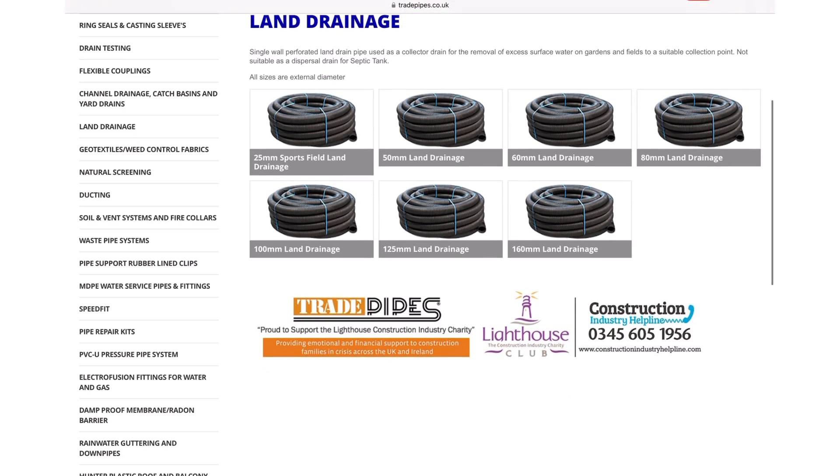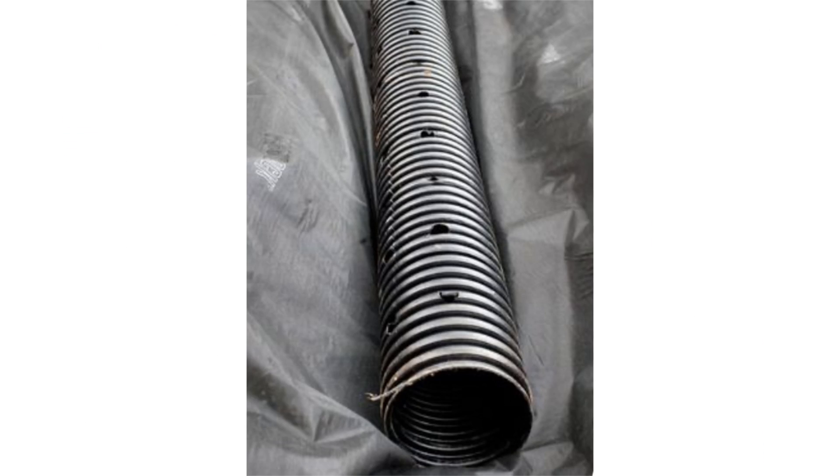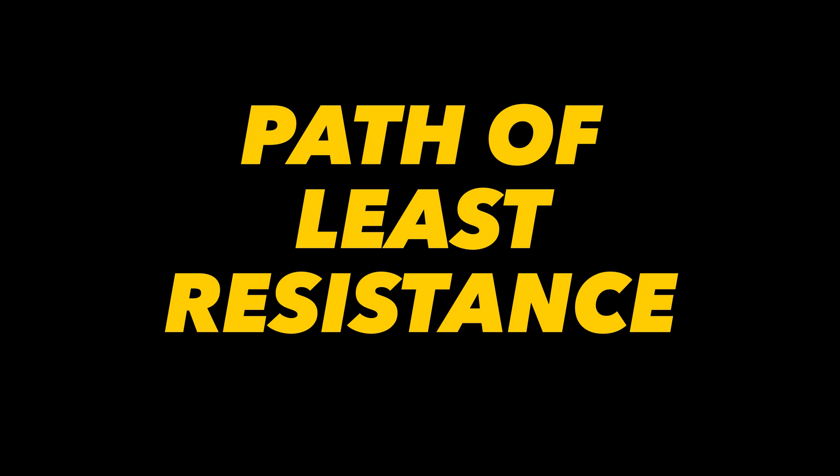I'm using this perforated reinforced PVC flexi pipe — about 60mm in diameter — and you need to make sure there are at least four perforations around its circumference. A field drain works differently from a conventional drain pipe. Bathroom and kitchen drains work by gravity within a sealed system on a calculated fall, but with the field drain it's not gravity as such but pressure that creates the movement. I'm aiming to direct the pipe downwards to guide the pressured moisture, but it's the path of least resistance we're creating — like politely opening a series of doors for the water to naturally flow through.